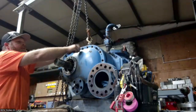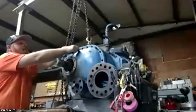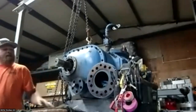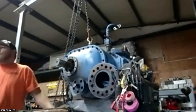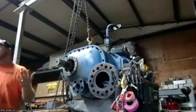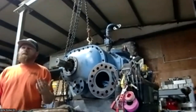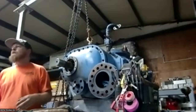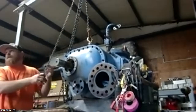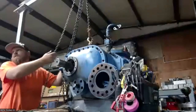It's bearing blank, it's bearing covers. So no more graphite impregnated seals like what was on compressors 30 years ago? Not necessarily. Everything's pretty much sealing on an O-ring. But the carbon faces, if you scratch one of those, a lot of that's going to come from dirty oil. When your shaft seal is leaking, it's going to be contamination 90% of the time. That comes from any seal I've pulled that I've had to have warranted, and they go, oh, it's contamination, no warranty. I think they just tell me that half the time.